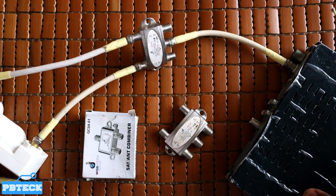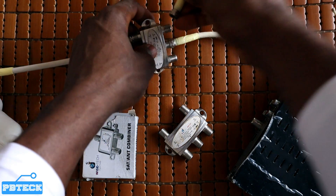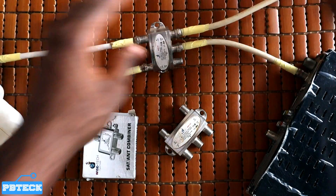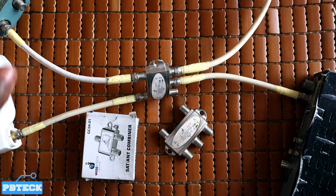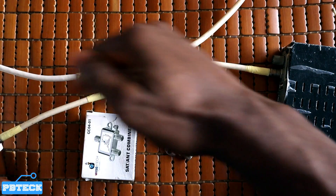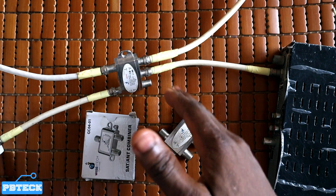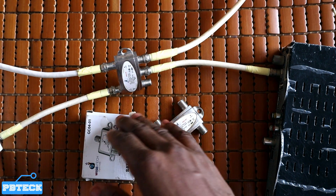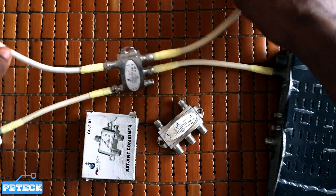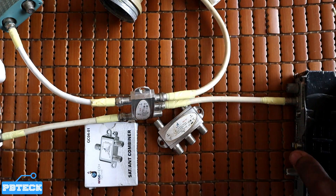This is how it should be if you want to connect three different signals or three different LNBs — it also connects onto another port. After that, go to the installation menu on your FTA decoder and do the necessary settings. You set the LNB number for each input — for example, if you inserted MultiTV onto LNB port one, whenever you scan MultiTV you need to select DiSEqC port one or LNB1 before you scan, so you get all the signals from each LNB working perfectly.